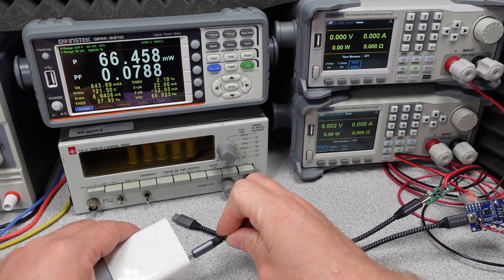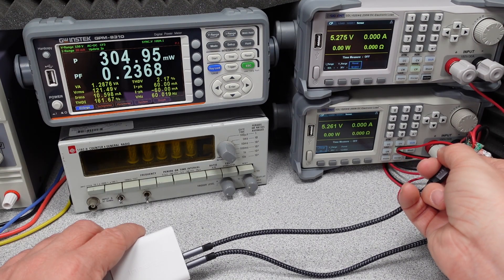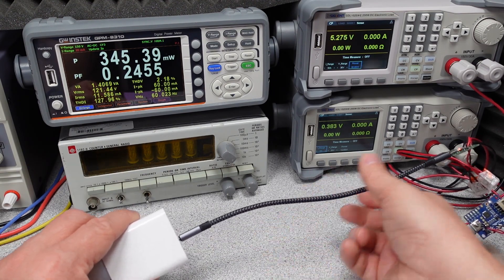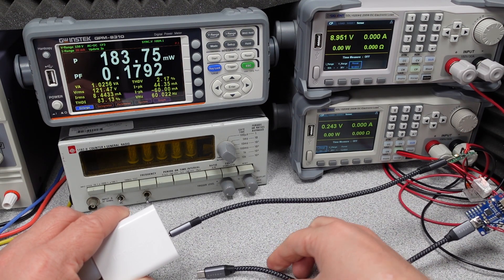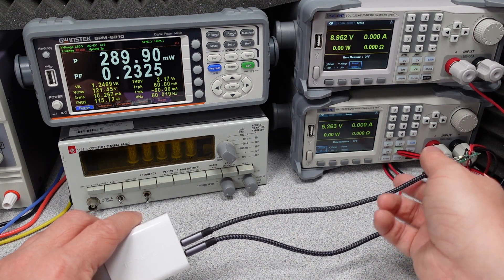The power is shared between the ports in an interesting way. It only renegotiates the power delivery if you ask for power delivery — so higher than 5 volts on that second port. The power adapter turned off when overloaded at 67 watts, which is a very reasonable overload limit. The idle power consumption is quiet and low — another win. However, the general performance is bad when taking into context the lack of power factor correction. The power factor stays low, and it has issues with crazy high peak currents. Note that the 60-watt adapter is using almost the same VA or apparent power as a 150-watt adapter. The voltages were all strong and within the USB-C Power Delivery specification.